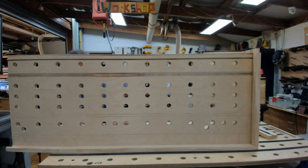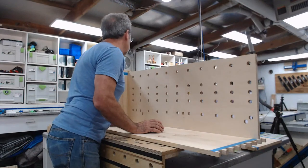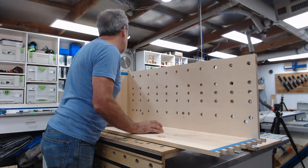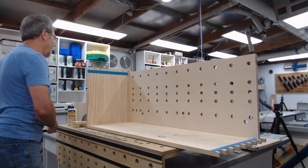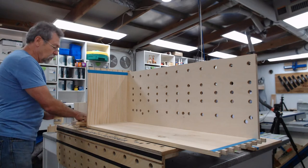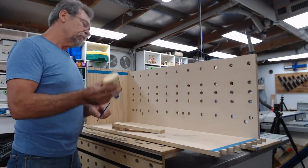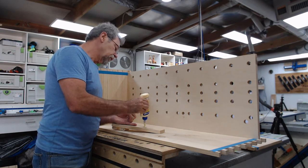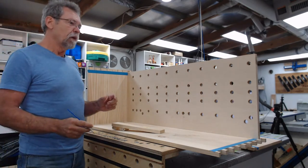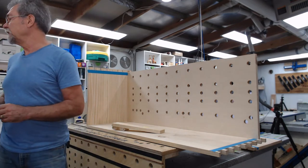Found it - it was under the bench. So we'll go to the other camera. Always do test cuts. It was under the Stanton bench. I'm going to put the glue on a stick. Remember, I've sanded all the inside. I haven't sanded the bottom because it's just the bottom. This will all be stained - it's actually a Jarrah stain. I was concerned it was a little red, but I'm going to finish with the Whittles Hard Wax Oil Satin because that gives me a bit of a yellow up. You can see on my toolbox that it has actually yellowed up.